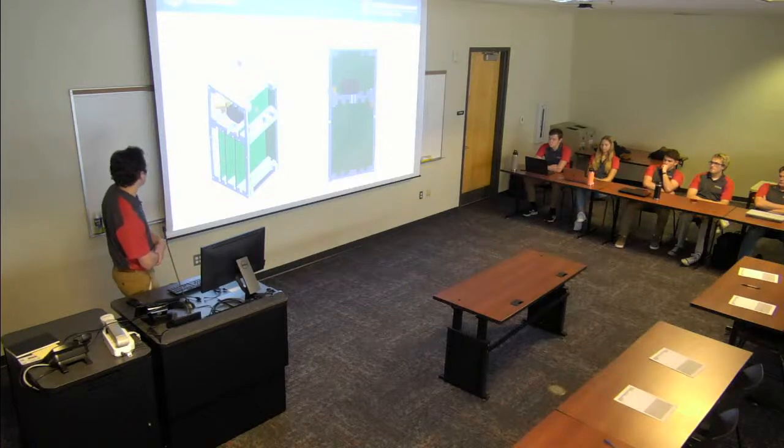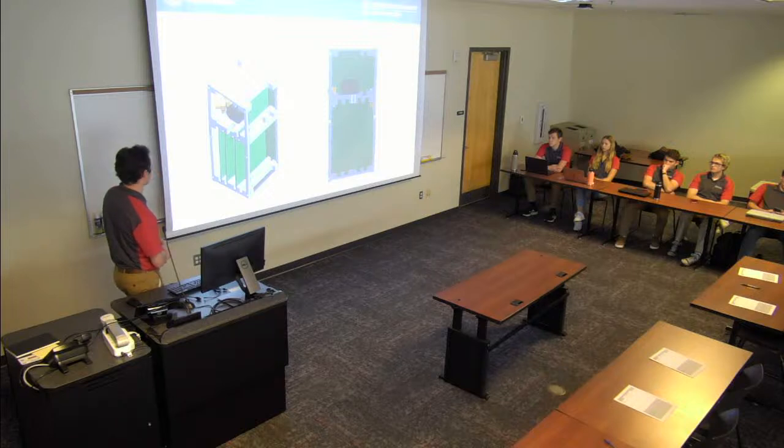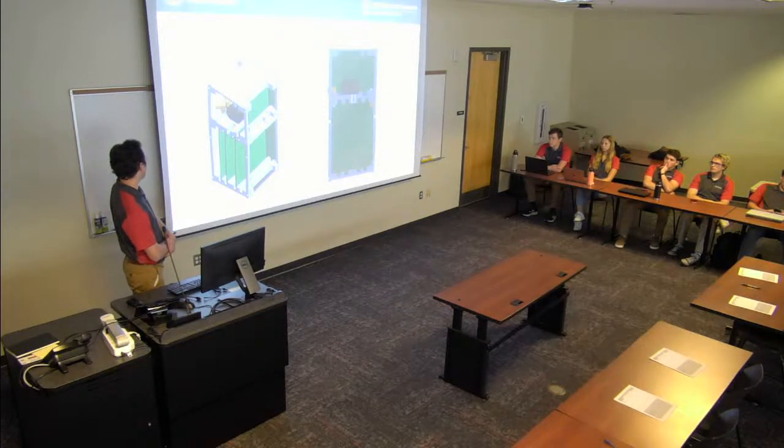These boards have a couple of dedicated purposes. This one up here will house the telemetry modem. This one here will house the SRAD altimeter and flight computer. We have our power management board right here, and then on the far left side, we have our commercial flight computer and the arming circuit associated with it. We also have connections up here on this middle bulkhead to connect to other systems of the rocket.